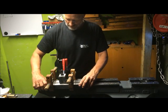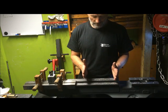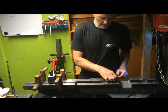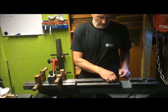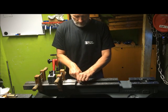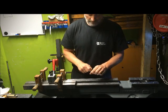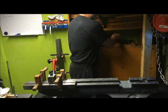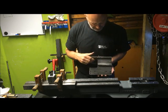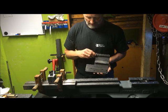Of course, on this machine, which is an old style machine, you have the narrow guide principle, where you have the saddle running on this front shear, and also the tailstock running on the inner front shear in the front way. I also, if you see the saddle here, also tried to use this, but it was a little bit flimsy.